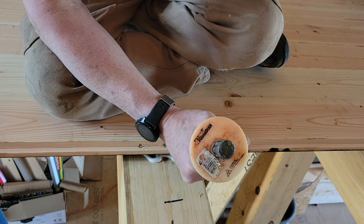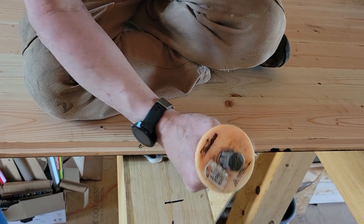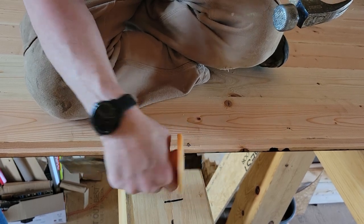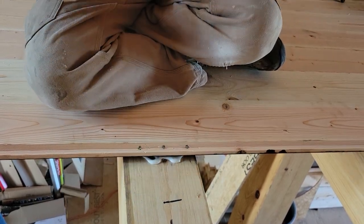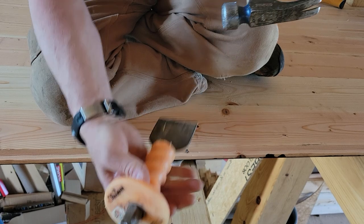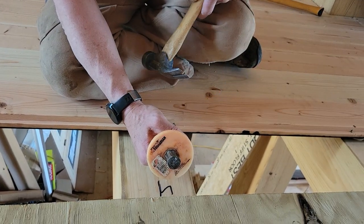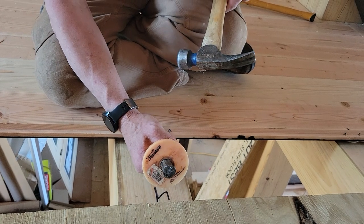You take this chisel and really smack it. If your nail is really aimed well at 45 degrees, just give it a whack and you'll drive it in further. If you have one that's giving you trouble, I've had more luck getting a shallow angle on it and knocking it into the wood sideways to avoid hitting the tongue.